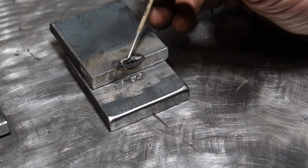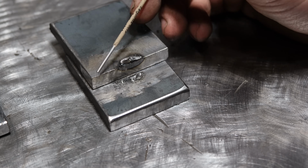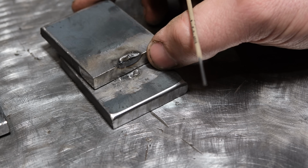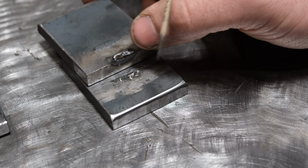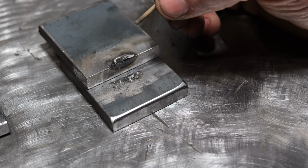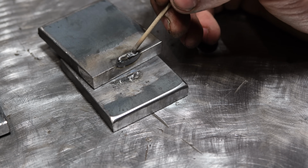Had this been this size, but with better fusion, aka running a rod bigger than this little guy, it would have performed likely very similar to the TIG weld. So it would have been up in the 2-ton, 3-ton range, very realistically. So again, nowhere near as weak as JB Weld. But it does go to show that if you can't weld and this is what you're putting down, maybe JB Weld is an option.